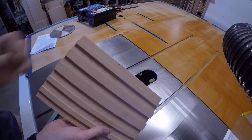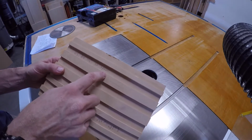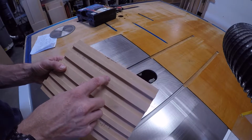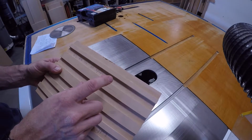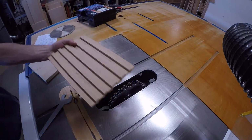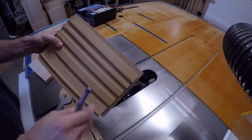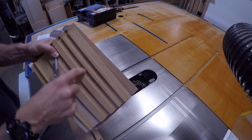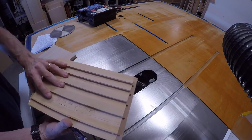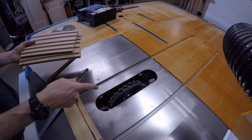And I wrote down here, ultralight MDF, 3/4 inch, no spacers. So this is essentially all the outside cutters, with the chippers 1/8 inch, except for that one chipper, then that's 3/32. That's all that is. I have 3 of them that I use, and like I said, you can have some for 5/8 material. Sometimes I use 5/8 material for melamine, if I ever use that stuff, but these work really well. Okay, so now we have this set up.